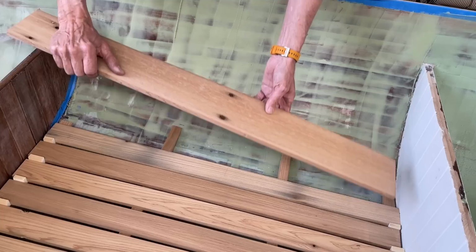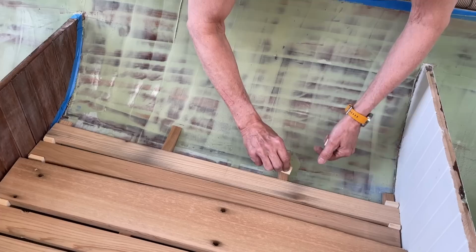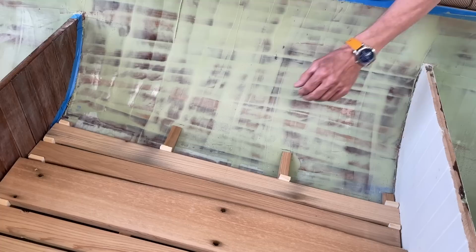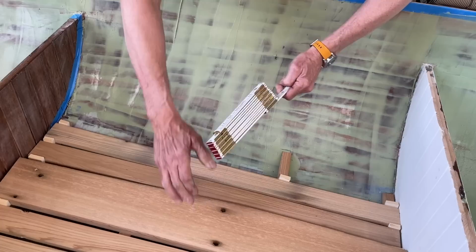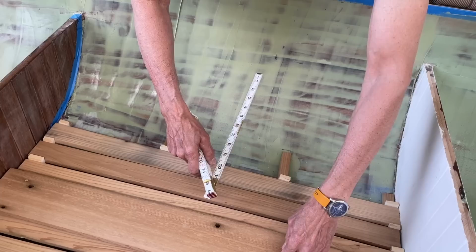So in order to get that proper curve, I have got some spacers that I'm going to put in here like this. And then I'm going to measure over at each station here. So that is 4 inches. So what I'll do now is mark at this point over 4 inches